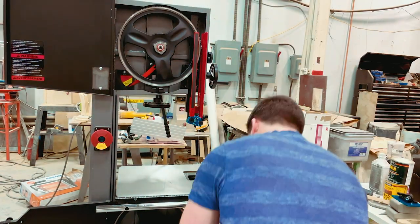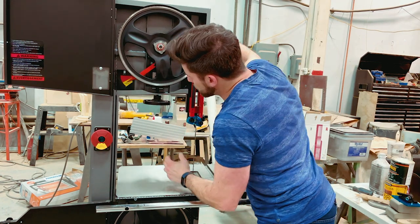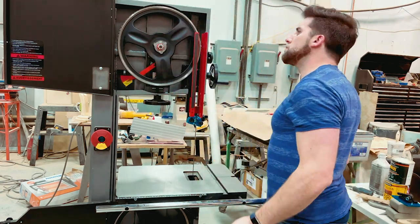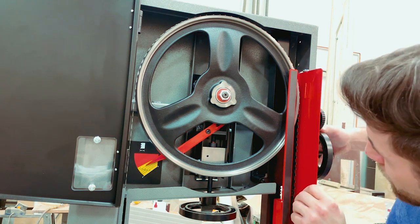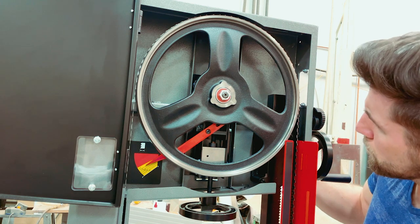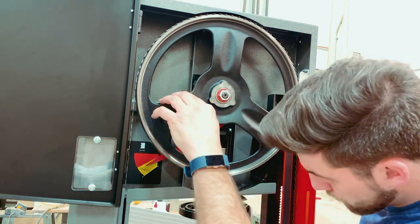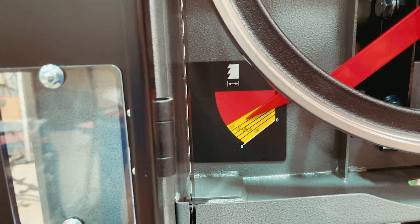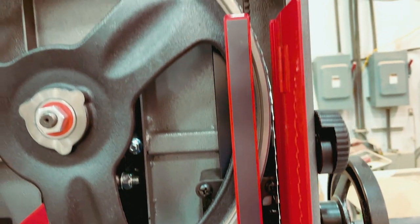We put the blade in through the side of the table there, turn the corner 90 degrees, and get it positioned on the wheels. Then we use the lever and the dial on the bottom to get the tension set — there's a gauge, it's pretty easy, you just get it set to the three-quarter-inch blade area. You're going to want to run the wheel a few times by hand to make sure everything's sliding correctly. You can take a look through the window on the side to make sure the blade is centered, which is a nice little touch. This is a crowned wheel with crowned rubber, so Laguna's recommendation is that you get the blade centered on there perfectly — not hanging off the end. I center my blades on the wheels, and with these crowned ones that's the way to do it. Or at least that's my opinion, but hey, what do I know?